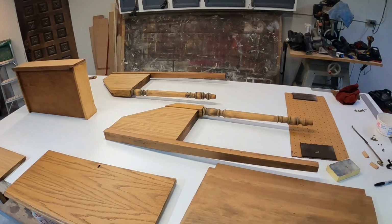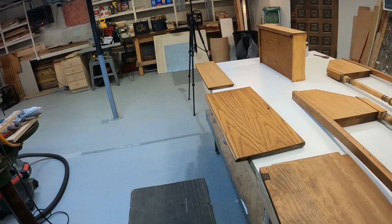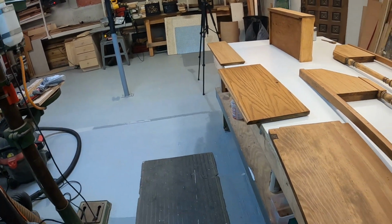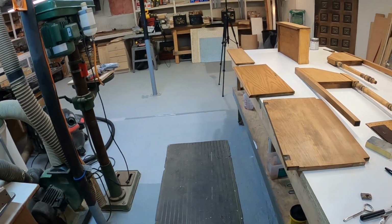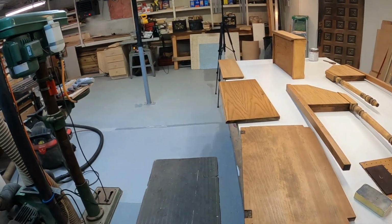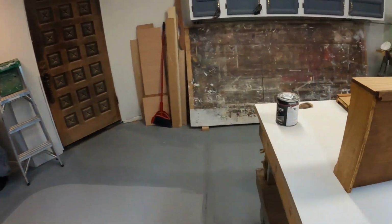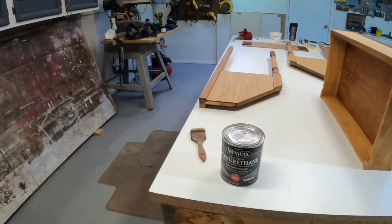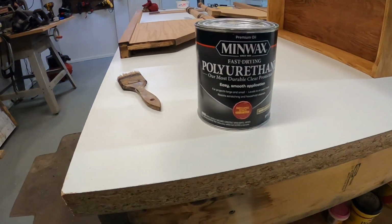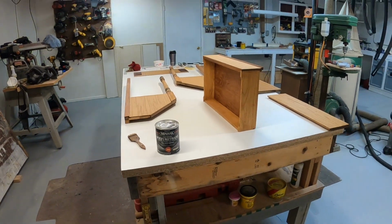And we'll go ahead and get this thing painted up with the polyurethane and let it dry for several hours. They recommend, I think, maybe 4 hours or something on this particular kind of polyurethane. It may just be 2 or 3 hours, but it's still a little tacky, I have found, after 2 to 3 hours. So I actually like to give it a whole day,